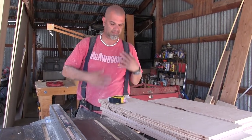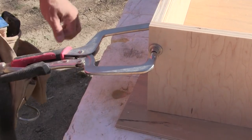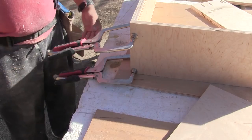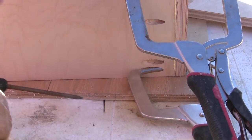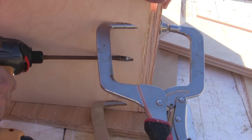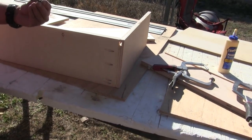You look like you've showered in sawdust. This is where the clamps just shine. I put two close together down here so I can have one holding while I put the first screw in. Then when I put the second screw in it doesn't matter anymore — I can take the clamps off because the screws act as the clamp and the glue will dry. That's another bonus of this system — with old-fashioned cabinetry you'd have to clamp it and wait for it to dry.